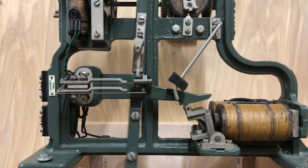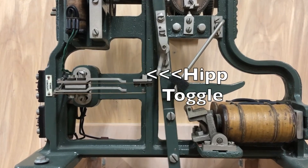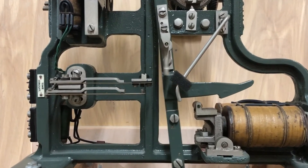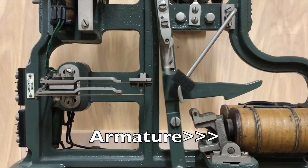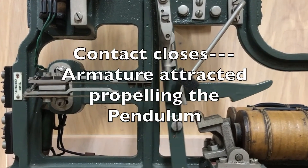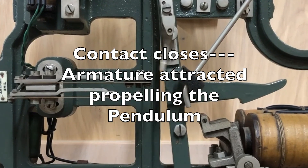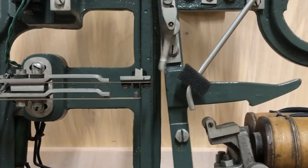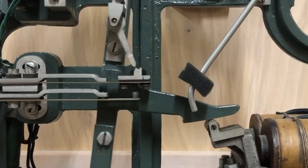This view shows the pendulum swinging. The tab of the hip toggle is swinging back and forth. As the pendulum swing gets shallower, the tab finally gets caught on a ledge and closes the contact. When the contact closes, the armature is attracted to the coils, and each closure of the armature propels the pendulum. This occurs a few times each minute. If the load is heavier, as with more dials, the pendulum will be propelled more often. Remember, the pendulum moves the hands but is not the timekeeper.